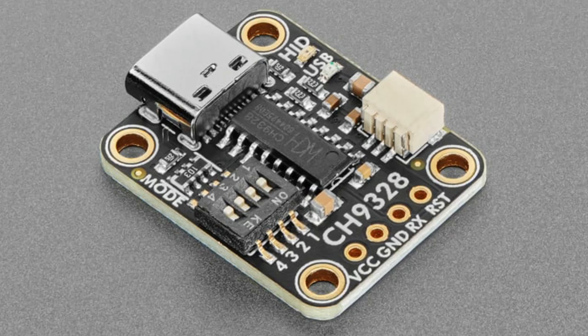And then on the RX pin at the bottom there, you connect to ground and RX, and then you send 9600 baud UART ASCII strings. And whatever you type in the ASCII string, like if you type out hello world, the chip will type out hello world. So whatever UART signal is sent into the chip, it pretends like it presses each key.